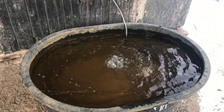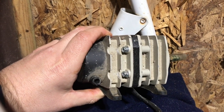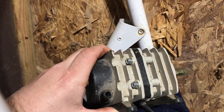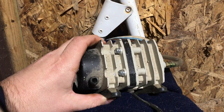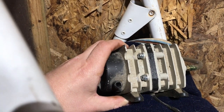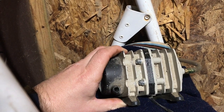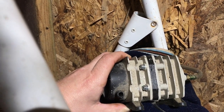If you can run a 20-watt aquarium bubbler as opposed to a 1500-watt water heater, you're going to be saving a ton of money. Here's our aquarium bubbler — it's quite small, 20 watts, which is much better than a 1500-watt water heater. In temperatures of minus 5 to minus 10 it works great keeping the water clear. When we do get colder temperatures, we use a timer to kick the water heater on and off — maybe half an hour at a time, two to three times a day. Working together with the aquarium bubbler, it keeps the water open and free from icing up, and saves a whole lot of money.